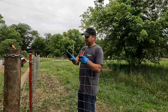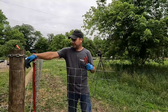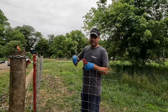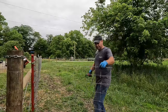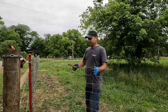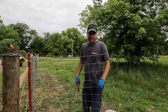And when you release that tension, it actually pulls on the post and it starts to turn it, because it wants to take where it's pulling right here on the side. It wants to pull it toward it. And I've actually had it twist enough that the horizontal brace would want to pop out. And that's the reason why I don't pull past with a tractor and staple it off hard. And that's the reason why I do it this way. And the other reason, of course, is it tensions this brace up. And I usually have pretty good success doing it this way.